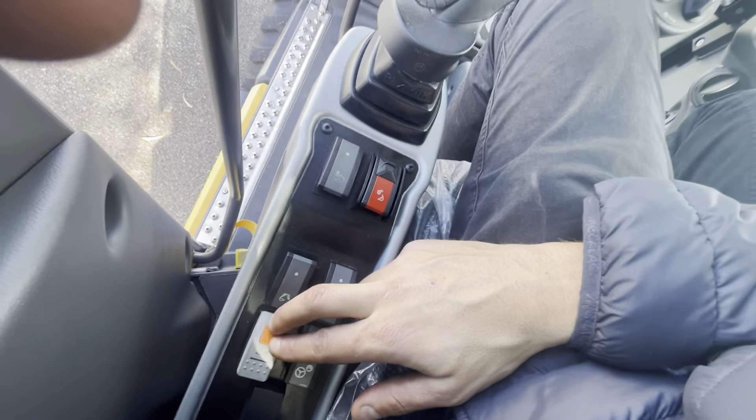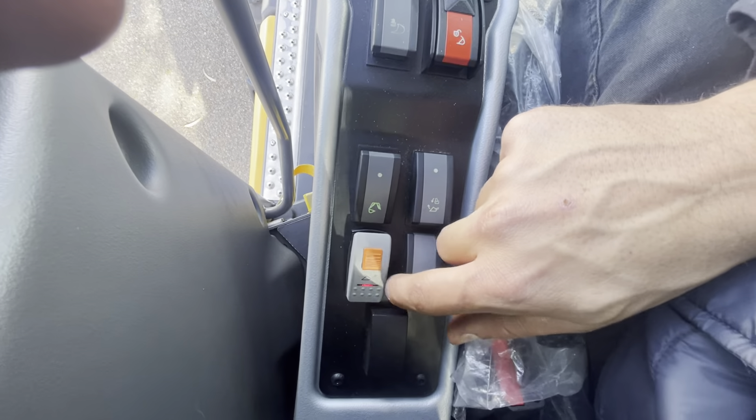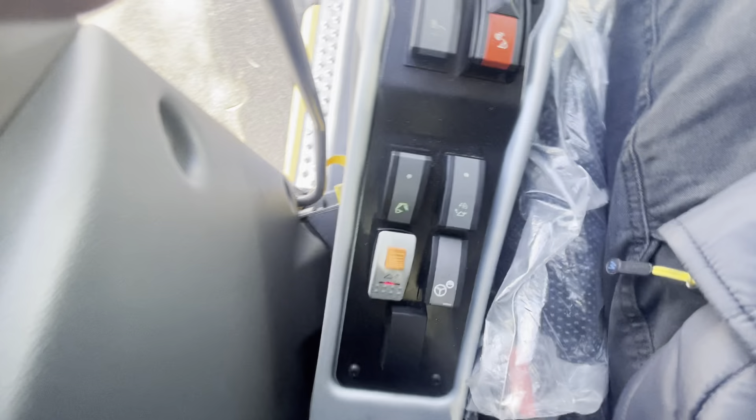And then this is your hitch switch for the bottom of the tilt rotator — so this is the Engcon system. You come down like that, hold that down — you've got the red light on, that means you're in change attachment mode. Then you need to hold this pinky button in here, and then you use this slide switch on the top there, left and right, to adapt it. When you drop the bucket off, you pick the next one up and slide it across the other way — that attaches it. Let go of your pinky button underneath, then make sure you turn this off. If you forget to turn this off, it'll time out after a while. And if you turn the machine off while it's in this position, when you turn it back on you're going to have an error code continuously beeping at you. What you have to do is turn the machine off, make sure this switches across to that position, and then turn the machine back on again, and then it'll be fine.